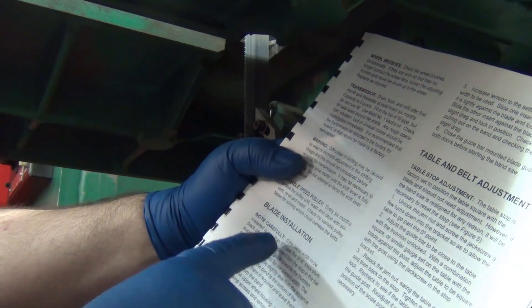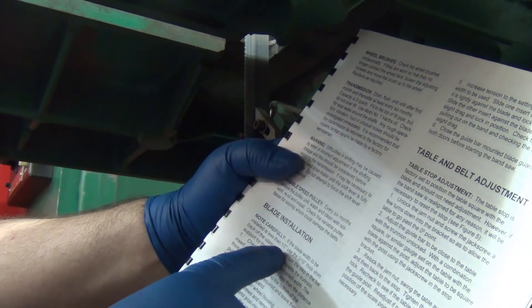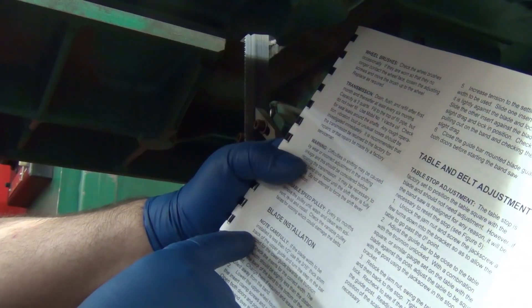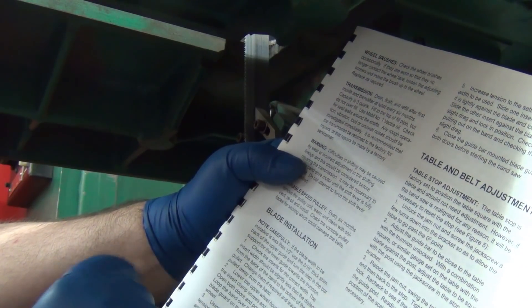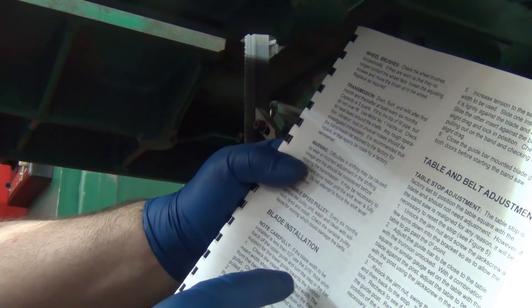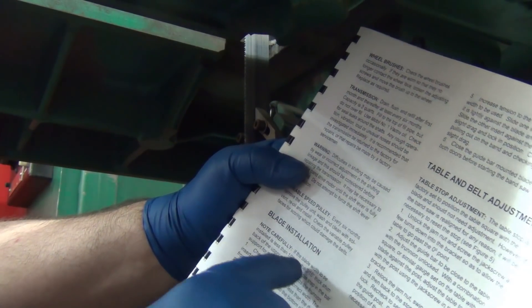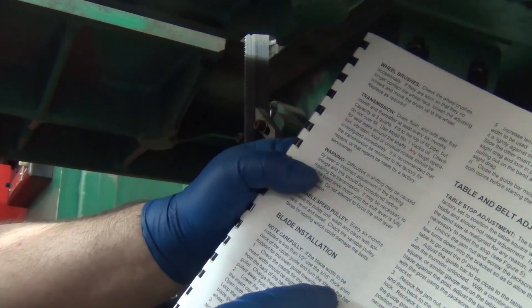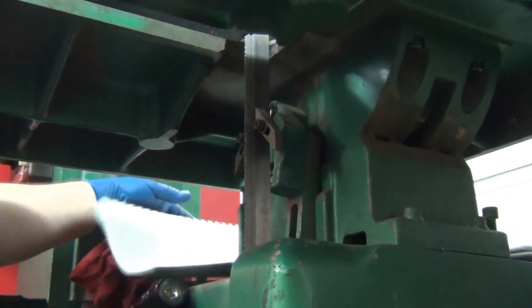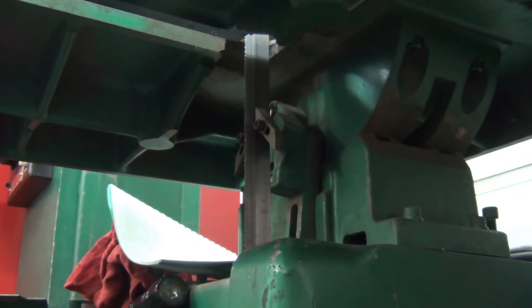You can find this manual online and download the PDF; I chose to buy a hard copy. It says: if the blade width to be installed is less than half an inch, use the 3/16th thick shim at the back of the upper guide and turn the step bar — the step in the bar support for the lower guide — toward the trunnion. I know what they're talking about on the top one; I'm concerned with this step in the bar for the lower guide.